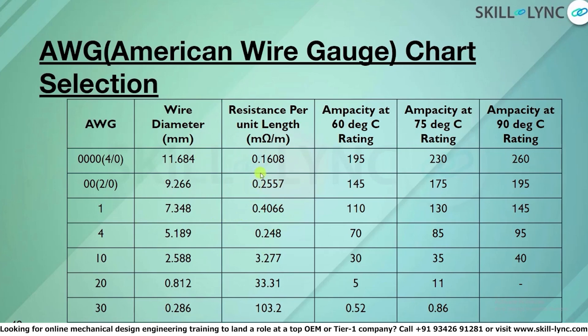You need a good cross-sectional area to transmit a high amount of current through the wires. A 4/0 wire at a 60°C rating can deliver 195 A; at 75°C, it can deliver 230 A; and at 90°C insulation rating, it can deliver 260 A. This means you need an insulation material rated for 90°C to be able to deliver up to 260 A. If the insulation material is insufficient, you must choose one that allows the wire to carry as much current as required.